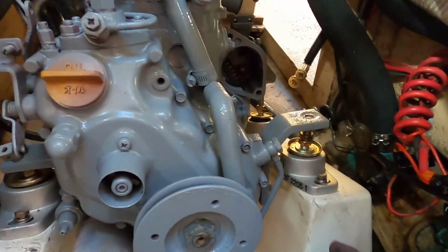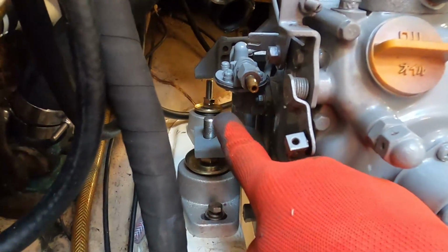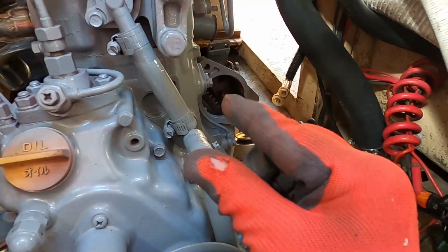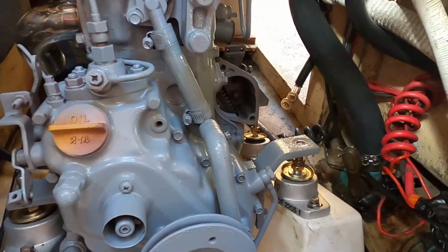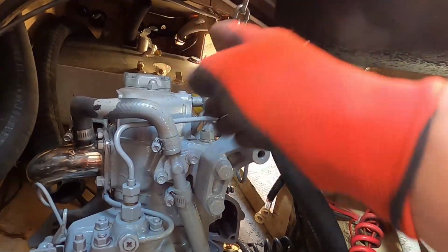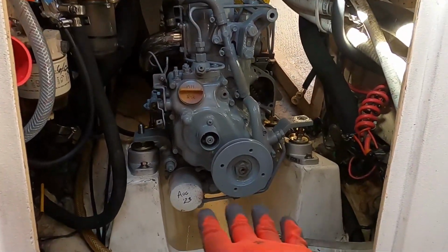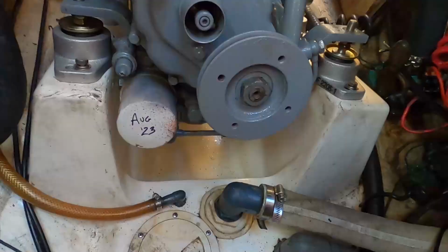Okay, this is a real bear, but we've got the engine on two mounts. The mounts are all loose on top of the carriage there. We're trying to get the rear in, and the problem is that the output shaft flanges are overlapping, and it's causing us trouble. It's binding and whatnot. To make matters worse, the hoist point is not center of gravity, so as soon as you put tension on the hoist, the engine racks. And of course the bed for the engine is not flat. Anyways, we're working on it.